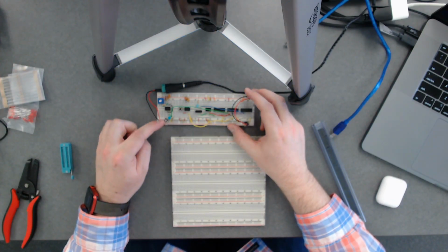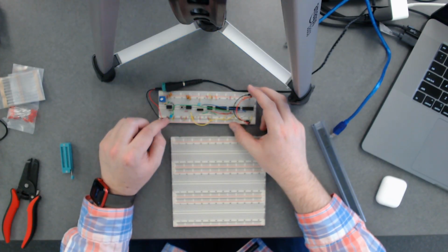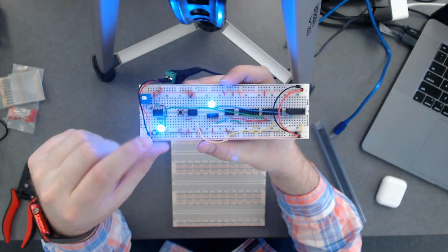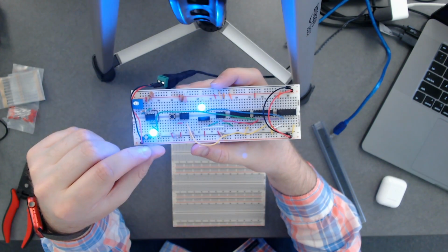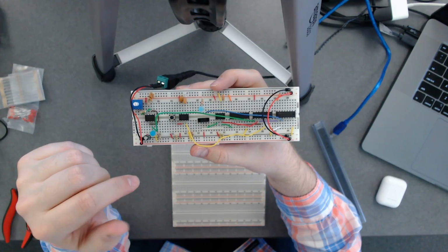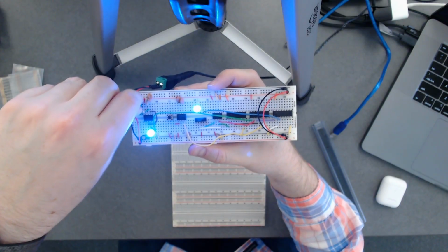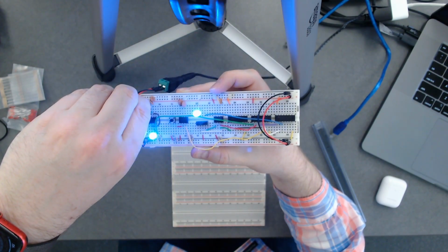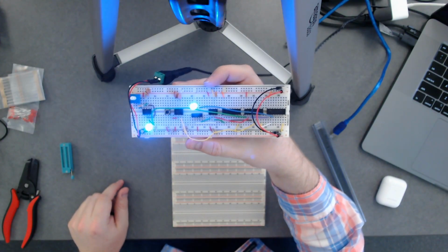So what do we have here, right? This light is controlled by the potentiometer, as I was explaining to Cole earlier. Right here we have a capacitor, and the capacitor is going to basically charge and discharge, and the rate at which it's able to fill or discharge is controlled by a resistor. That's what the potentiometer does: it adjusts the resistance. By increasing the resistance we slow it down, and by decreasing the resistance we speed up the frequency at which it cycles on and off, okay?